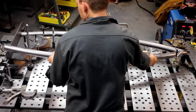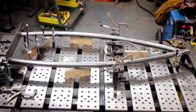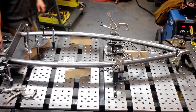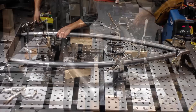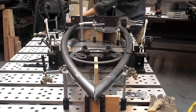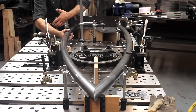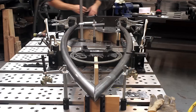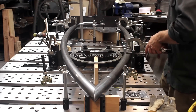Welding order is pretty important on a piece with curved tubing. I would do four or five tacks for the base of the tubing to the base plate, and then at the peak I would do three or four tacks — about two and a half inches of the seam at the inside of that joint. I'd finish weld so that most of the distortion would happen while I was set up in the fixture.